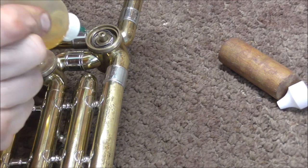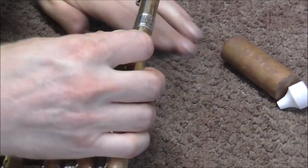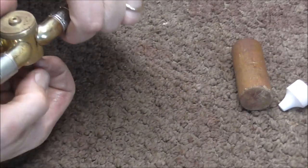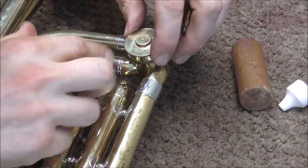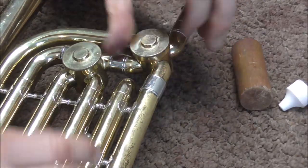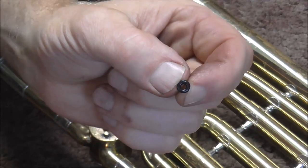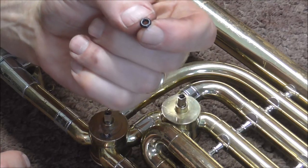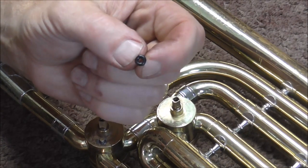Then I am going to put some oil on there, and then the rotor plate. I need to line it up, tap it in, and check how it works. Seems to work. And then these caps protect the rotors, so I will put those on. These valves have the unusual system with the o-ring that goes right there, but one of them was broken. Someone suggested that I go to a car parts store and buy some o-rings, but I am going to try the hardware store first and see if they have that. So I am going to head to the hardware store.